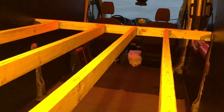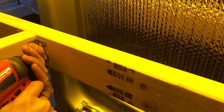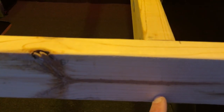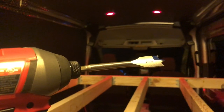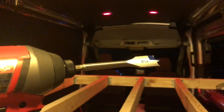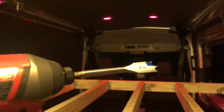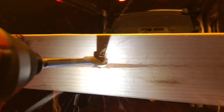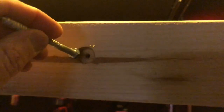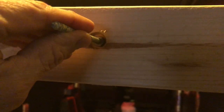This is pretty solid. I have an open space over here to the right for bicycles and storage. We're using three and a half or four inch lag screws for added support. For these lag bolts, we're going to use a speed bore to go ahead and make a recess for the head of the bolt so that it will be flush.